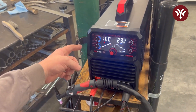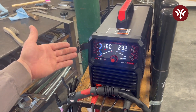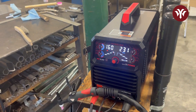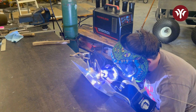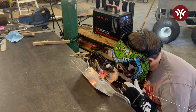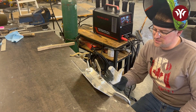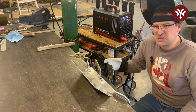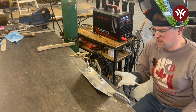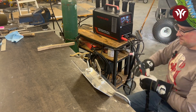The moment we've been waiting for — we have the welder on. Today we're using the YesWelder CT 2050 to do all of our AC TIG welding. It's a great machine — I have a review on my channel, check it out at Centerline Designs. We have it set up for AC TIG with the foot pedal at 160 amps, so let's get welding. I just turned the welder up a little bit — I'm welding a piece of three-eighths to a piece of one-eighth, so there's a significant thickness difference. This big thick steel table underneath helps heat sink for that thinner material to let the temperature difference get closer between them, so you wind up with a more consistent weld.